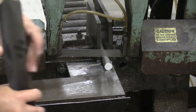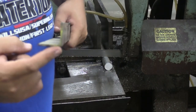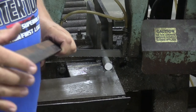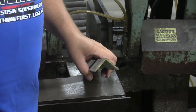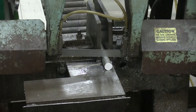Some materials like angle iron are a special case. If we lay it flat we have a good wall here but the other leg is vertical. A lot of times with angle iron you set it down like a V, so you've got a little bit of teeth in each wall — the blade comes through nice and easy. That's one way to help that type of situation.